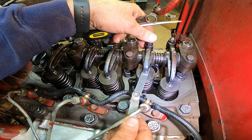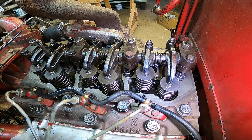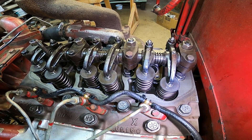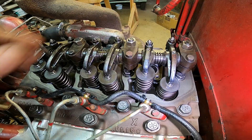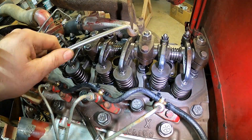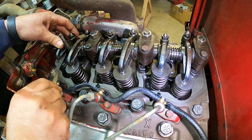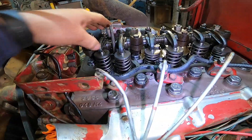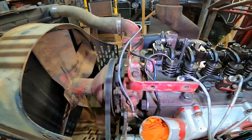It slides in with just a little tension, so that's exactly what we want. With it on top dead center compression stroke — this is a D179 engine, three cylinder, so it'd be different on other engines — we'll be able to adjust valves one, two, four, and five. I got all those valves set. You just gotta take your time because they will move a little bit when you're trying to tighten that lock nut down, so just keep checking them as you're doing it.